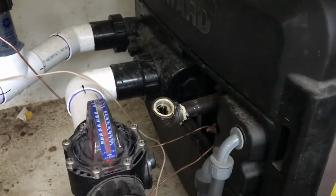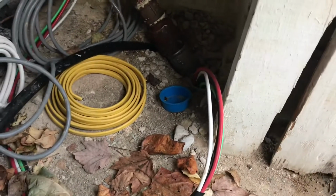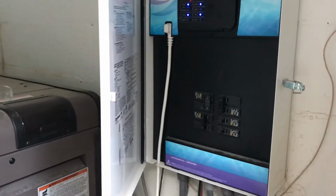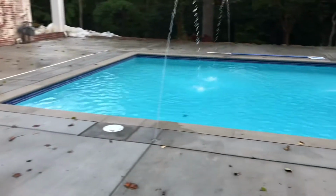So I'll get that straightened up and put one of those concrete anchors here and bolt the gas line to it, and then it'll come out of here and go to the gas line right there. Provide gas to our heater. We also have a 3/4 inch water line here and an electric conduit that comes from the house for power supply here. So I'm going to get a couple things finalized here, but really it's pretty much done. I got to get our automatic water fill hooked up, and that'll be nice. We won't have to keep an eye on the water quite so well.